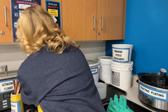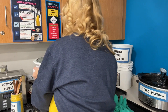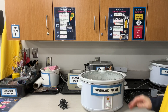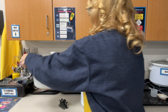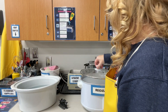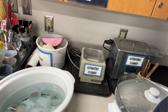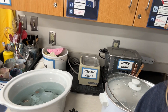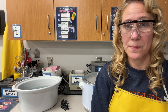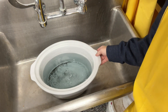The first thing I want to do is make sure that the pickle pot is unplugged. I'm going to lift it out and then take the crock pot out of the part that heats it. I'm going to make sure there are no pieces inside. If I take the lid off, you can see there are still pieces inside the pickle — so I have to take all the draining pickling containers out. Once all of the pieces are out of the container and you have placed it in the sink, you can start to neutralize the acid.